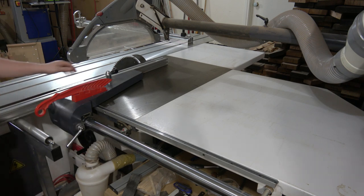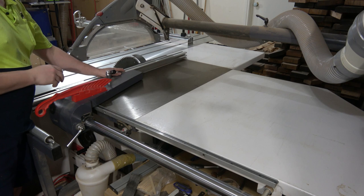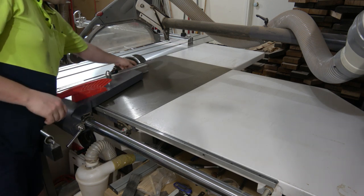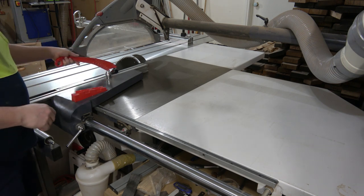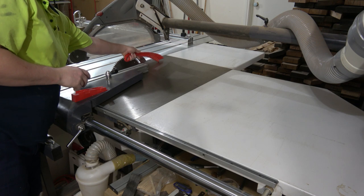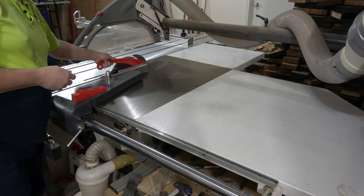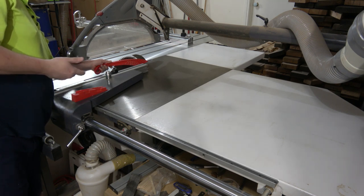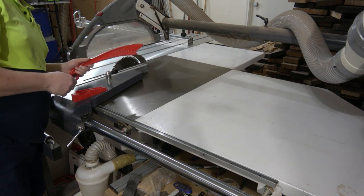Say I'm ripping 100mm wide timbers. On a standard table saw fence, you've got no option — the fence is always all the way past the blade. That's actually a bad way to rip timber. The correct way is to have your fence set just past the halfway point of your blade. That way, when you're pushing through with your push stick, you push here and it's clear — you don't have to keep pushing back past the blade. When your hand is back there somewhere, it's right next to the saw blade — a really bad situation. Whereas here, you come through and you're done; your hand isn't even up to the saw blade yet. So even if you were dumb enough to put your hand in the blade path, you've already finished pushing and don't have to push any further.